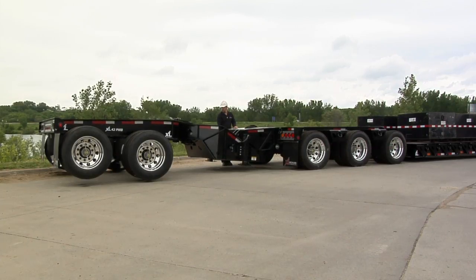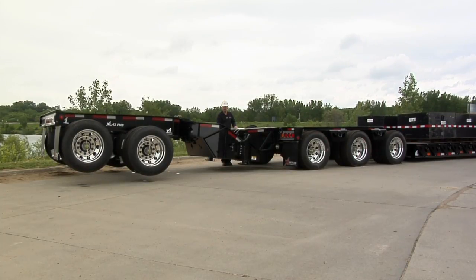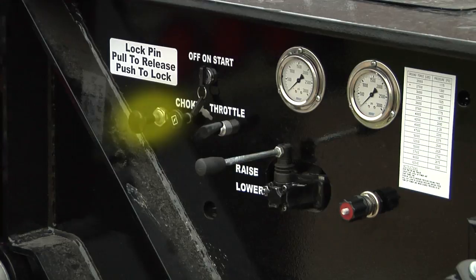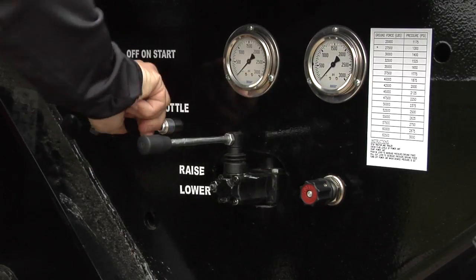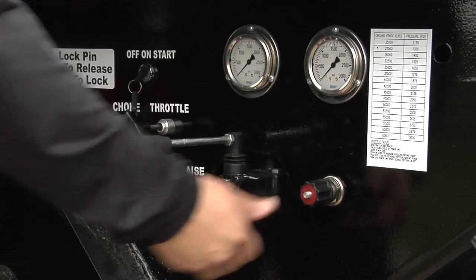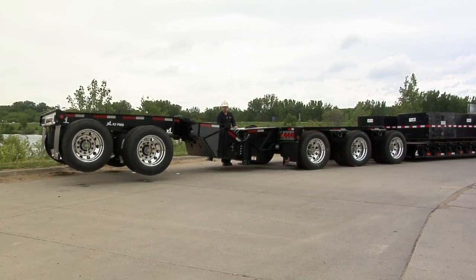Lifting the axles on a Power Booster can help drivers get out of rough ground or change a tire with ease. This position should not be used in on-road applications. To lift the booster axles, the tractor and trailer should be at a complete stop. First, pull the push-pull knob on the PMB to lock it from rotating. Check fluid levels on the power unit and make sure that the booster bleed off valve is fully closed. Then start the power unit. Open the bleed off valve to relieve pressure and leave the valve open. Push the lever to lift axles into the air to the desired height. Then close the bleed off valve, release the lever, and turn off the power unit.